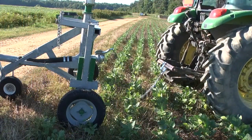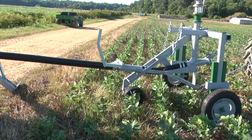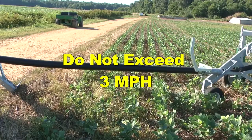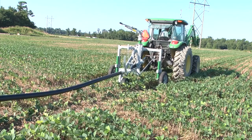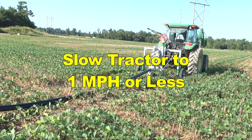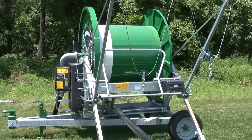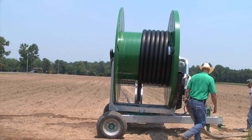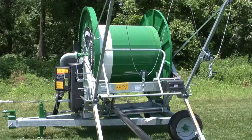Pull the sprinkler cart out the desired distance. Use a gear in your tractor that will not exceed 3 miles per hour at full throttle. Pull the tube out at a steady speed and do not exceed 3 miles per hour. Do not start or stop during pull-out, as this contributes to spool coasting and may result in loosening of the tube. Slow the tractor to 1 mile per hour or less for 50 feet prior to stopping. You should never pull the tube out 100%. Always leave at least 2 coils of tube on the spool unless you are verifying timing. The only time you pull the tube out its full length is to verify timing. Timing will need to be verified if this is the first run of the water reel. For instructions on how to time your machine, please see chapter 4 of this video.